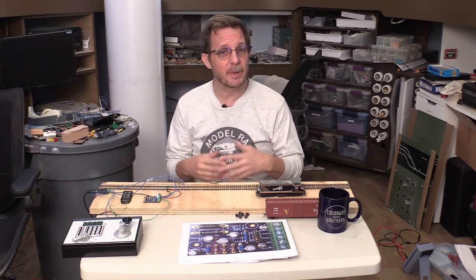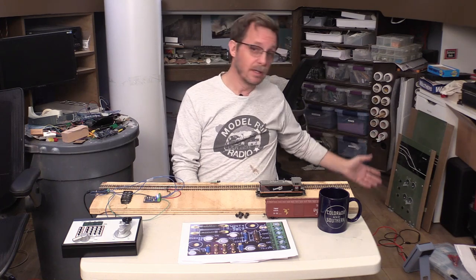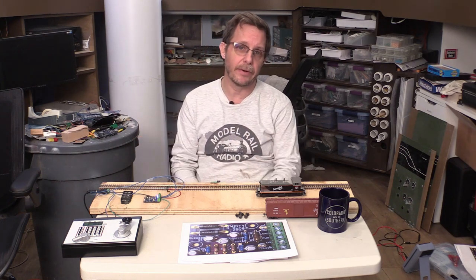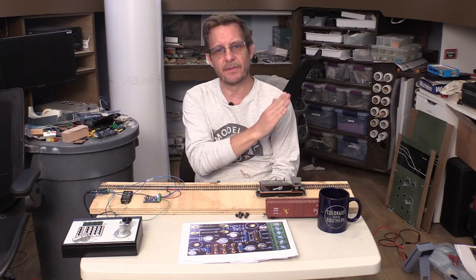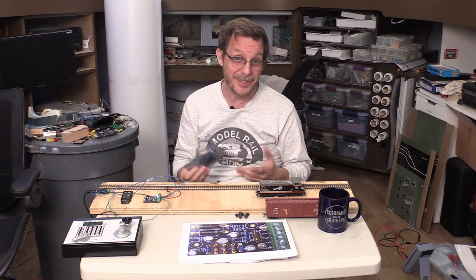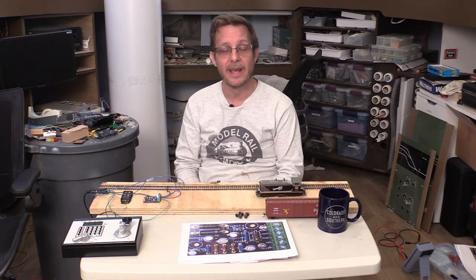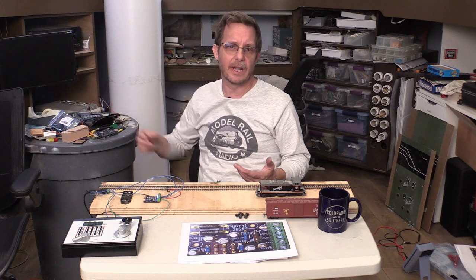Now, if you're doing a digital panel, you can manage that through programming, but it becomes a little more complicated. You can do it easily on an analog panel if you want to just simply have multiple sensors all feeding to the same LED. They will in turn, with a resistor in there, light up and you'll be able to tell throughout the whole thing, even if you put multiples in there. And frankly, if you're doing the infrareds, at a buck a piece, that's dirt cheap. It's really hard to argue against putting 3 of them into a 12-foot block to manage a 6-foot train, you'd be fine. But again, if you only have an engine in there and it fits in between, it's going to slip through and it's going to be present and you're not going to have a light.